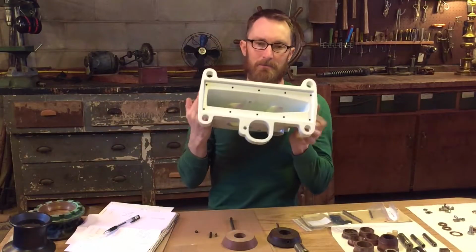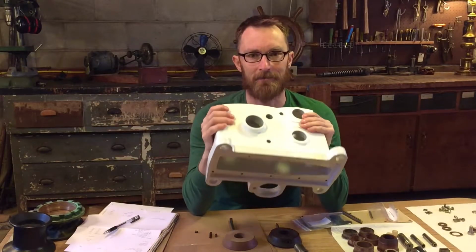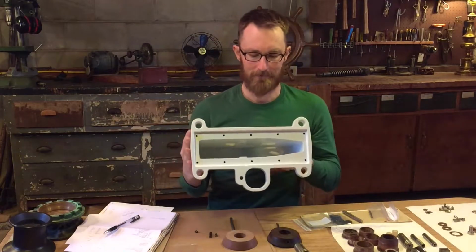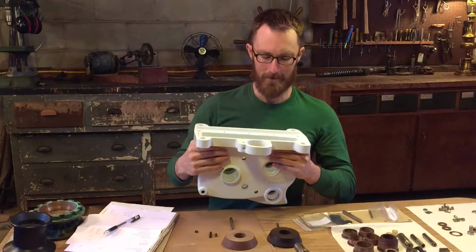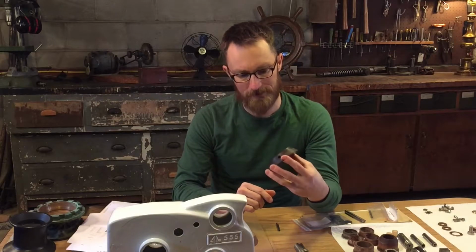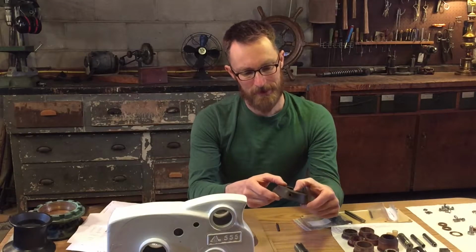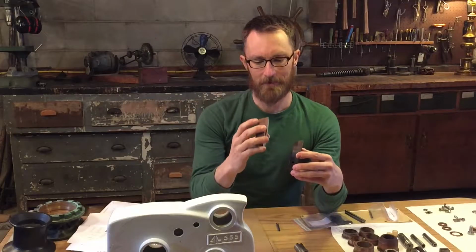When we got our windlass, it seemed to work fine, but it wasn't installed on the boat, and there wasn't a really good way to test it under load. Although everything worked fine, I wanted to take it apart and clean everything. Eventually we got everything out, and I realized that the clutch cone, which is a phenolic laminated disc, had a slight tear in it. It seemed to work fine, but just to be safe I ordered a new one.